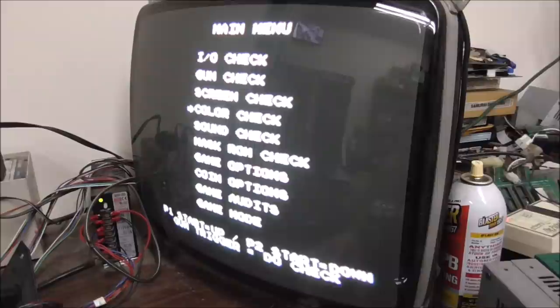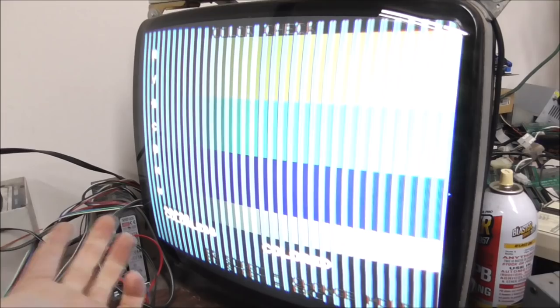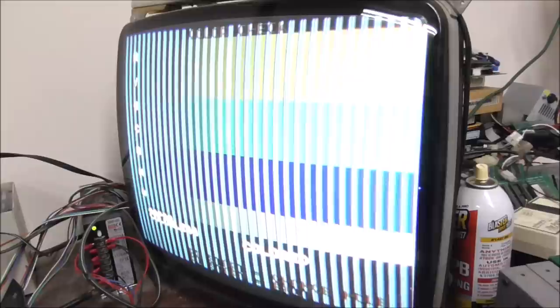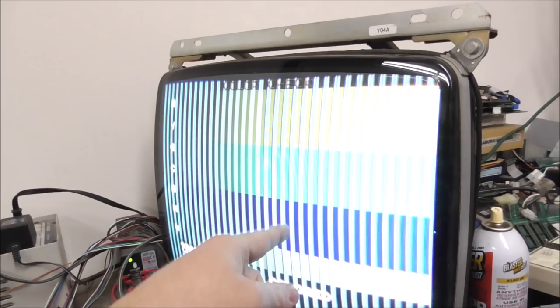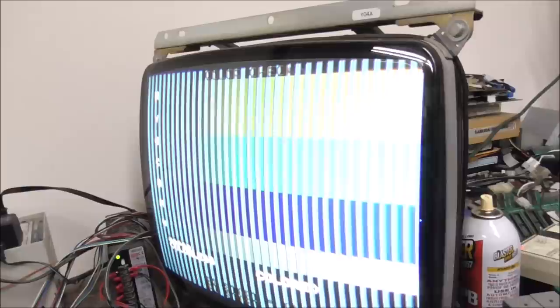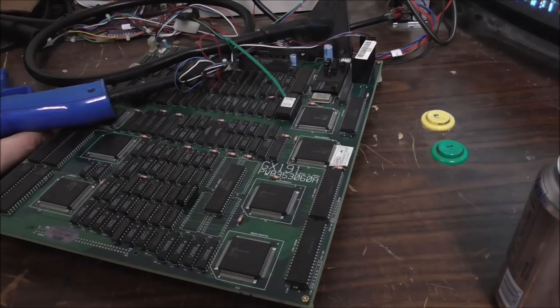Color check. No, it did not fix itself. This screen has me kind of confused because this is saying red, yellow, green, cyan, blue, magenta, white — but we don't have that going on. When you go screen to screen: red, green, blue, white. I would think that maybe this should be red, which would lead you to think that it's some kind of color RAM problem or something. The reason I go through this is because I'm trying to figure out which areas of the board it's probably not, so I can exclude those and not work on those.